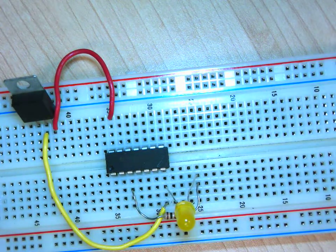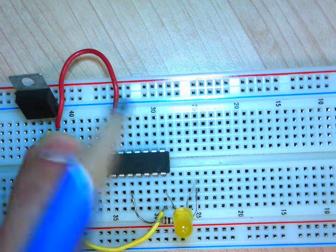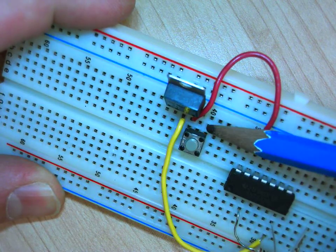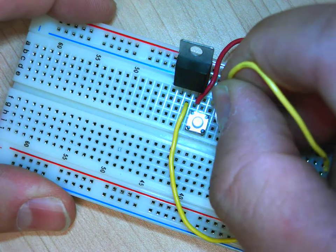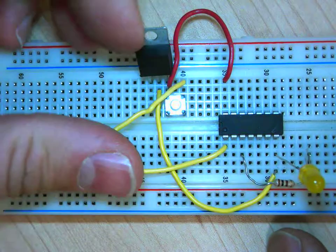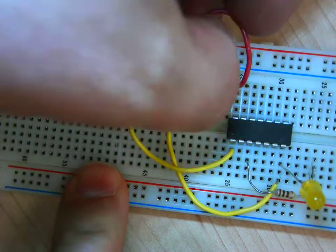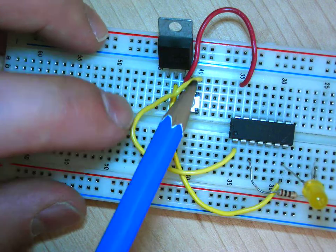Well, I'm trying to make it simple here. Okay, so how about I wire one straight on my out here, which is my 5 volt. So how about I wire one right here? Now notice it's 2 rows away, right, to connect back, right? So you need to know that, right? So I'll wire from my 3rd one, right? So here, actually I'll go here, and then I'll go to pin 1. Okay, so now my push button is connecting on my VCC, which is my 5 volt, touching here 2 rows up on 40, and then I'm throwing this to pin 1.